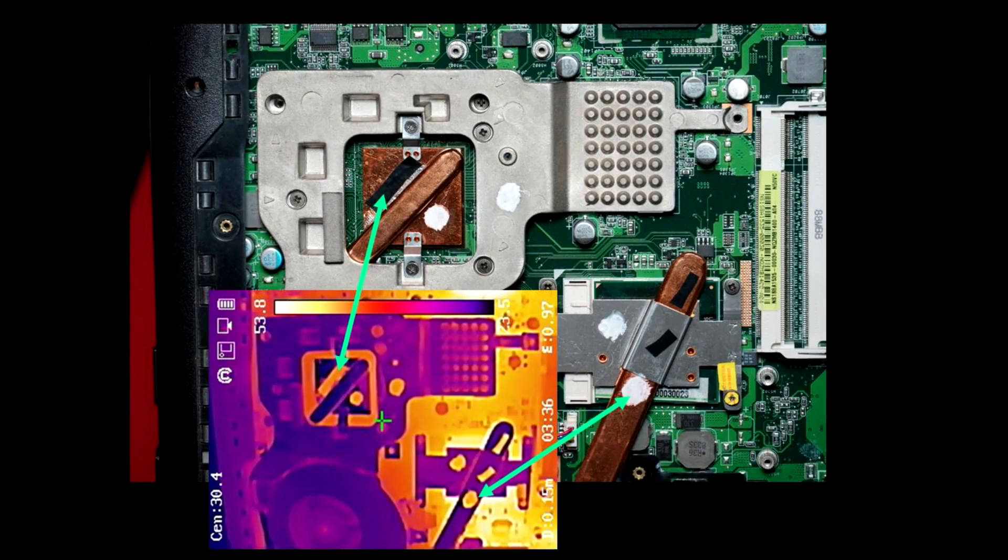So this is a mainly reflective surface, whereas this other is a mainly emissive surface. You either know all of the emissivity coefficients of the various surfaces — which is not that easy to do — or you try to change the surface properties. One common way is by applying materials with known emissivity coefficients like electrical tape, or just painting everything with a thin layer of non-conductive paint which has a known emissivity coefficient. At least be aware that the emissivity factor can induce some really large errors if not correctly taken into account, and a measurement made without strict control of the analyzed surface and surroundings can lead to false results.